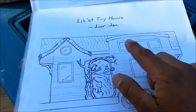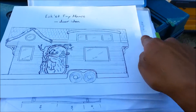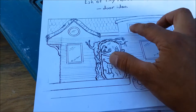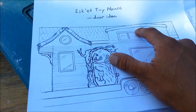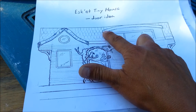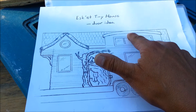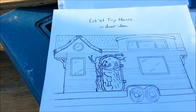To get that curve — think of it as a massive circle — you can figure out the diameter and all those little triangles. What I did was lay it out on the material. At the middle of each divided measurement I measured up three inches, then I bent a piece of wood from point to point and drew an arc. I measured up between each divided line and mirrored the exact image on the other side, then just cut it out.